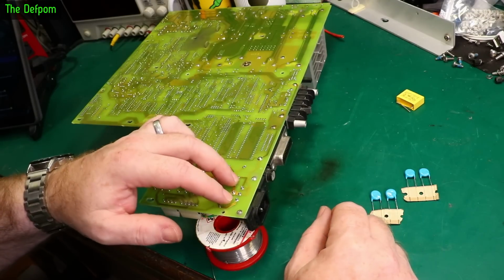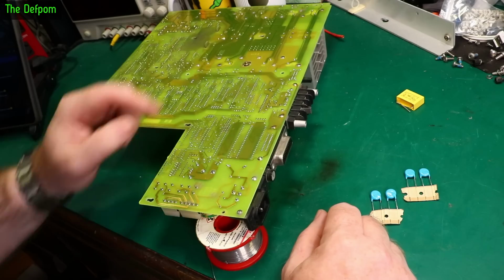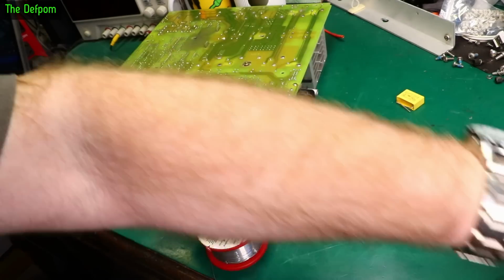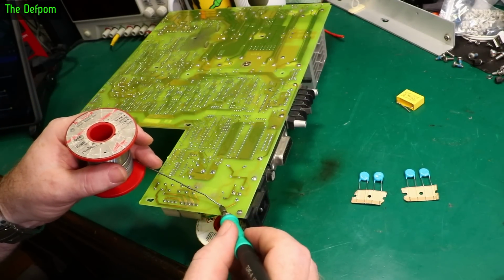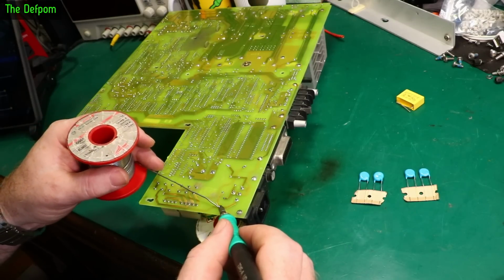This is mains filtering, and that's tying the outputs to the ground, so it's got a slight ground reference there to the actual outputs, so I think it'll be fine. Not ideal. If you've got a different opinion on that, let me know. Chuck it down in the comments.